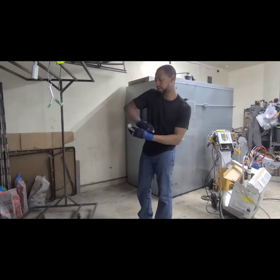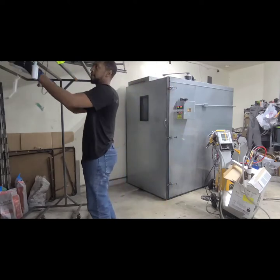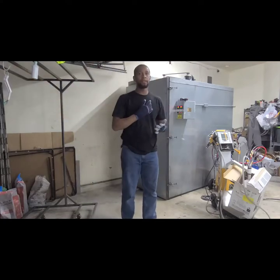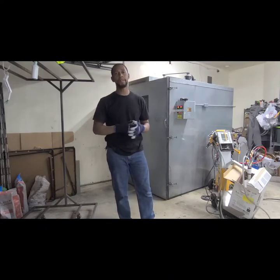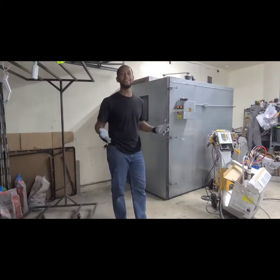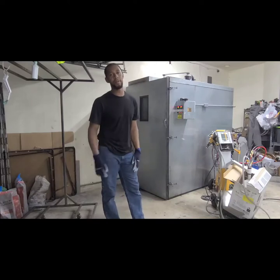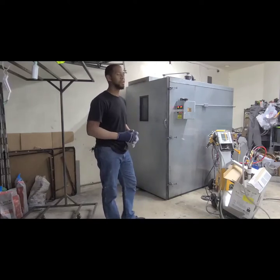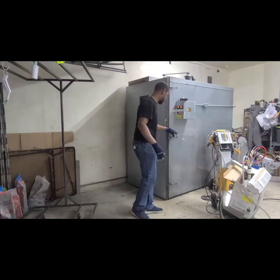Let me see the valve covers. The bake time for these also is 400 degrees PMT for 10 minutes, which is once the part gets to 400 degrees, 10 minutes is how long the part needs to be at 400 degrees before it's considered fully cured. I tend to leave it in a little bit longer if they have over bake stability, just to make sure you don't have any problems later, but they're ready to go. So let's see what these guys look like.